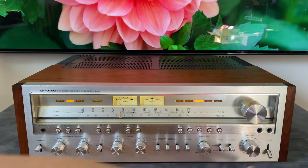Another thing that makes it really nice is that the output cards are identical. I would think any manufacturer would want to do things this way, where they don't have two different PCBs, mirror image, that they have to construct. They just construct thousands of these output cards, and they can work in either the left or the right channel. This makes it nice for troubleshooting, because if you have one channel that's not working properly and you've confirmed your output transistors are fine, you can swap your driver cards as long as you turn down the bias a little bit, and you can figure out if everything is good on all the connections by flipping those cards and get it isolated very quickly.